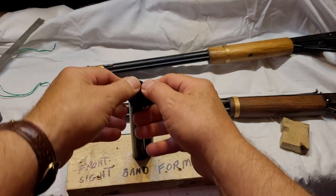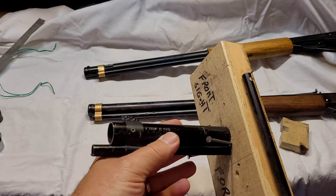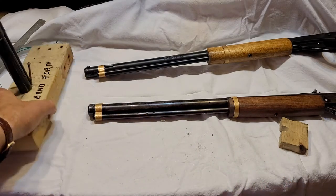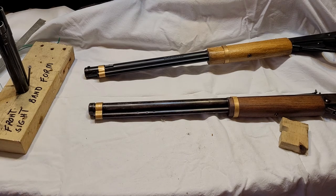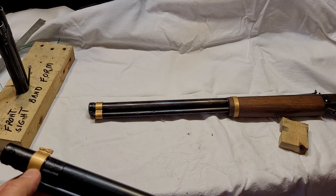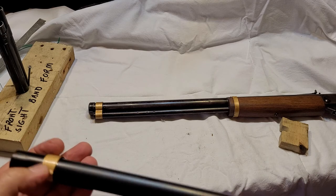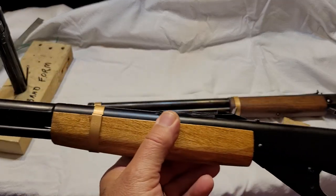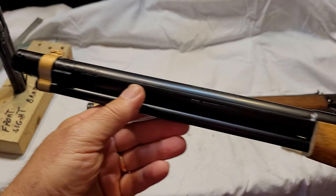The fact that I'm using a thin piece of steel gives me the opportunity to form it to whichever gun I have. If there's a little bit of deflection, this will work just fine — I can make it fit on any one of them. So that's my solution for not having an original sight. What I did with this gun was push it all the way back as far as I wanted it, secured it in that spot without using screws, and cut it back for a little bit of a taper on the ramp.